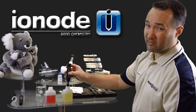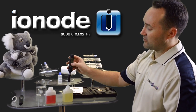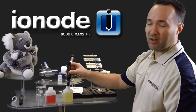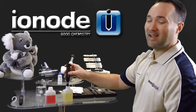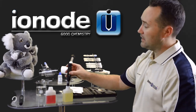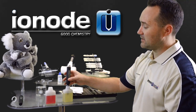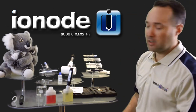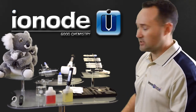Now, do you want to take the very first reading right away? It's probably okay, but if it's the first time you've ever used your electrode, you probably want to put it in the buffer, swish it around for a few minutes, give it a little bit of time to stabilize. I wouldn't take it right out of the box and right into a calibration. You're going to get a little bit of drift if you do that. What I would recommend is you let it sit in that pH 7 buffer for 10 or 15 minutes, just to give it time to stabilize and adjust itself.